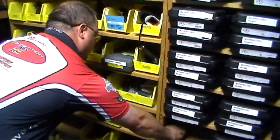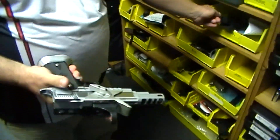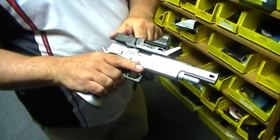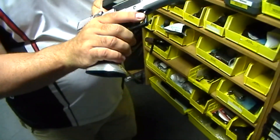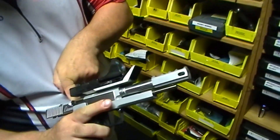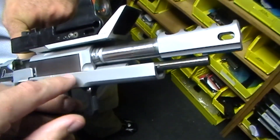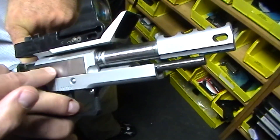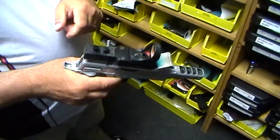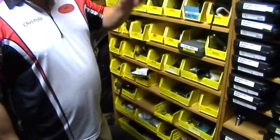This is his personal open gun. It's a Dawson Signature Series minigun stroker. So this is a shortened gun and then the stroke on it has been extended by something huge on this one. It's just stroked so far. He's done some relieving inside the frame and slide to where the slide comes back even further than it should — that looks like it might be longer than a quarter of an inch. What that does is it gets better reliable feeding. And so when you see a gun labeled as a stroker, that means it's had that work done. That's exactly right.